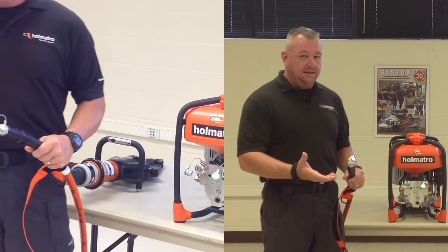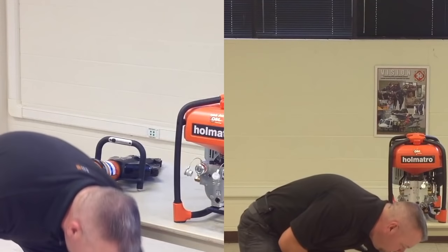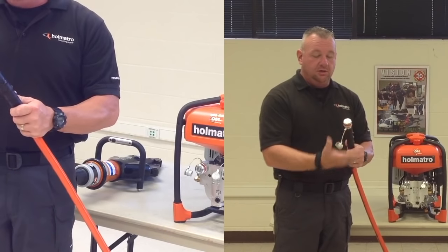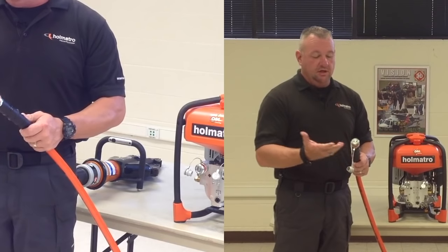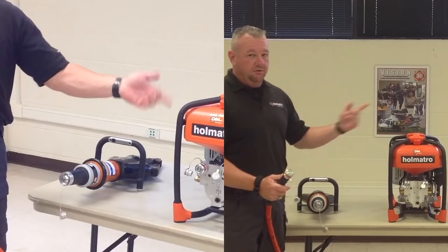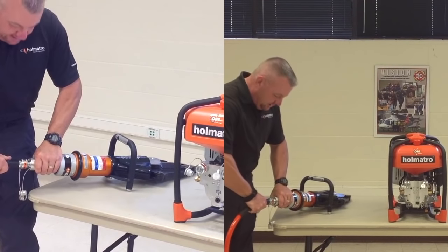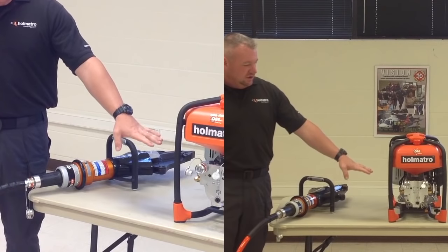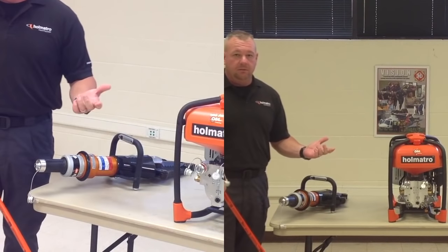Your couplers can be lubricated with any type of oil or silicone lubricant and kept clean with soap and water. The female coupler on the bottom end of the tool — the dust cap is removed the same as the pump, by a quarter turn and sliding it toward the hose; the cap will come off. If it gets used in a muddy situation, clean it out with soap and water, re-lubricate it with some silicone or penetrating oil, and it's ready to go again. To connect the tool, this can be done with the pump running or the pump off, and can be done before you hook the pump to the other end of the hose — there's no set order to it. Line up the couplers and push it together and it will snap in place. To disconnect, just like the rest of your Holmatro systems, there's no need to shut the pump down or interrupt any flow — it's just a quarter turn of the collar, that will slide back, it will come apart, and you can go connect to the next tool.